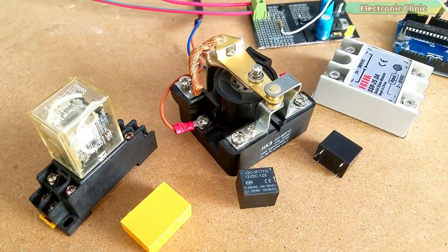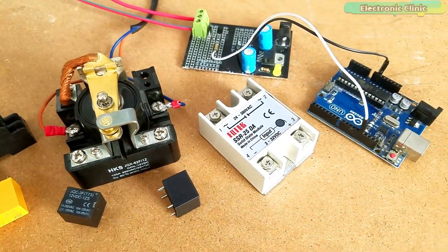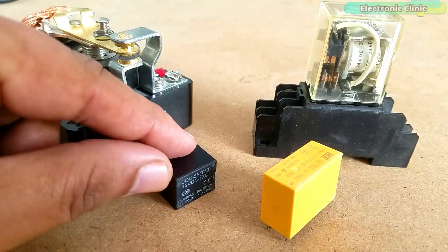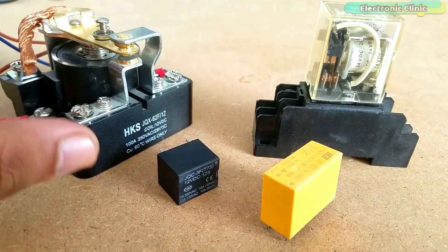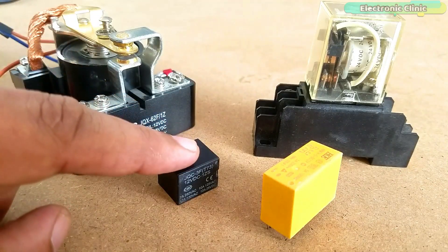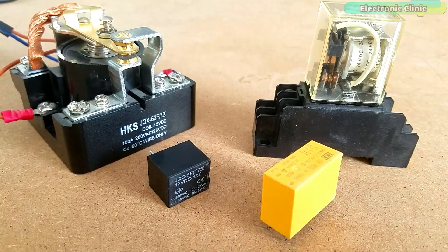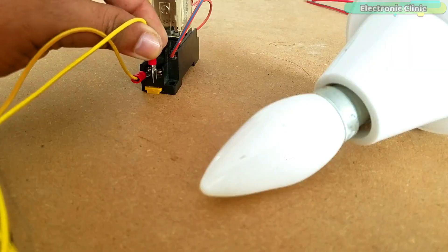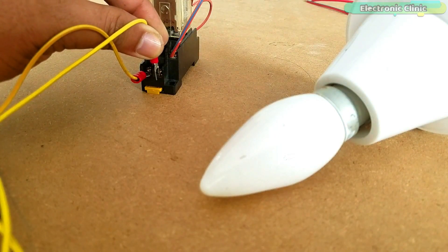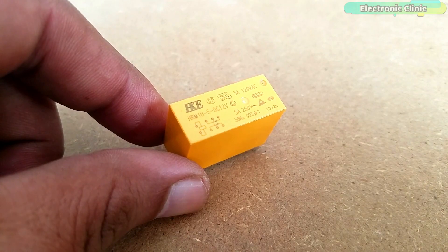The components and tools used in this video can be purchased from Amazon; purchase links are given in the description. These are four different types of relays, different in shapes, sizes, and pin configuration. It really doesn't matter which type of electromechanical relay you are using — the working principle is exactly the same. All you need is to connect the desired voltage with the relay coil contacts, which can be 5V to 48V, and this is normally printed on the relay.